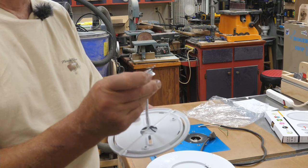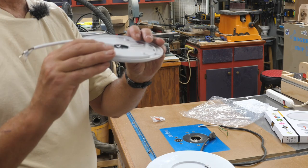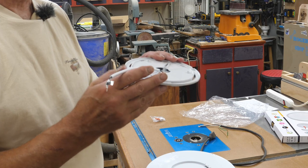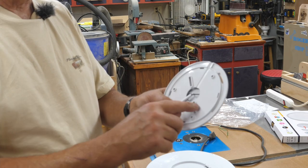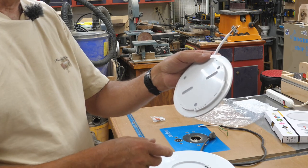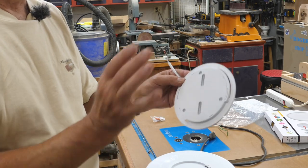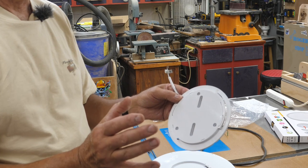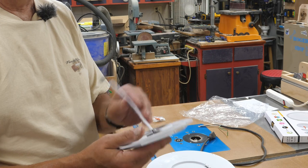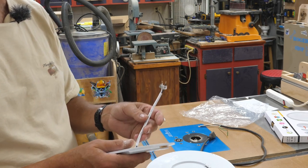There's a cord on it — mark line and neutral, and you would wire this up. This really should be in a box — don't be just freewheeling wire around, make sure there's a box behind it. There are holes here to mount and go up onto your box. They also give you three holes to anchor this, but if you're in the United States, follow the National Electric Code, put a box behind it, don't just fly wires to this. That's wrong — I'm an electrician, I know that.